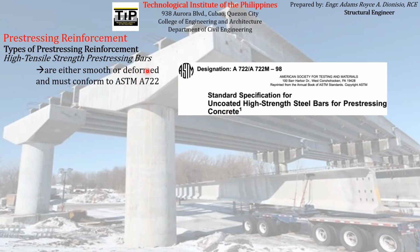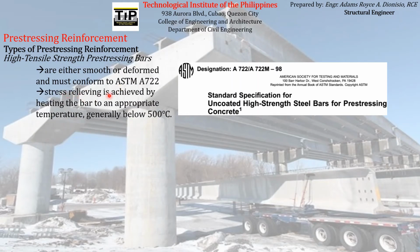If you can imagine, these are like the normal steel reinforcing bar, but when used as pre-stressing reinforcement. It can have deformations, just like what I showed a while ago for non-pre-stressing reinforcement, or it can have no deformations, a smooth bar only. Stress relieving is achieved by heating the bar to an appropriate temperature, generally below 500 degrees Celsius. So you can make the pre-stressing bar stress relieved by subjecting it to a temperature below 500 degrees Celsius.